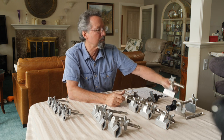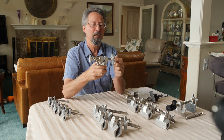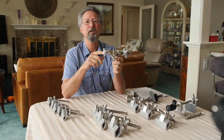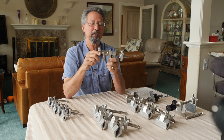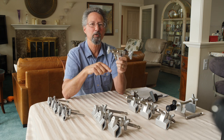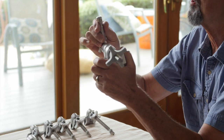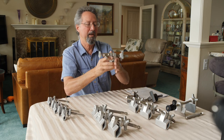The most recent one I built is what I call the right angle clamp. I have a distributor in Germany and he told me there's a company in France that started knocking off my clamps very near the beginning and made a clamp called a twister — a pin you could rotate 360 degrees with a knob to lock it off. The problem with it was like a C-stand head: if you put the load on the wrong side it would loosen itself. So I made this one to key every 45 degrees so you know it won't slip, and once you lock off the knob the pin is securely locked in whatever position you want.